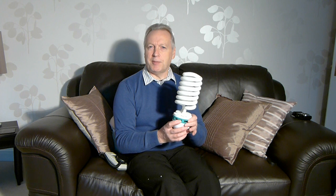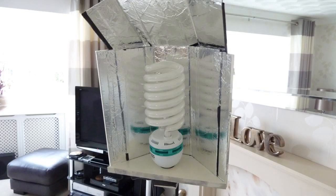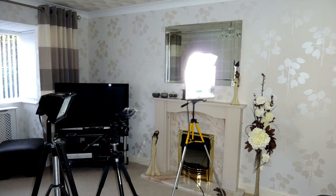So I started to experiment with some reflector designs, and the one I've got at the moment is the one that I'll show you in the picture, and it's working quite well. So I'm going to switch over from the linear tungsten halogen light to the light from this, and I'll rebalance the camera to give white balance based on this light. And you can see the resulting lux level from this light and the light quality itself. So this scene is now being illuminated with the light fitting I just designed and built around the 105 watt fluorescent fitting.